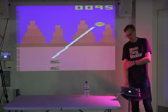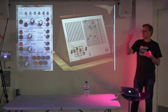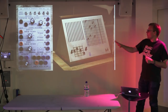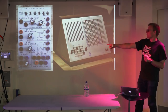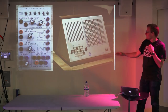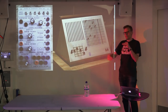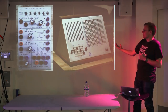At audio rates you get noise, but if you run it more slowly at a melodic sequencer speed, you can make different interesting types of sequencer. Many sequencers are based on this shift register idea done in different ways — the Buchla 266 random module from the 70s, the Triadex Muse invented at MIT in the 60s, which has sliders that determine how it feeds back to make long random sequences.